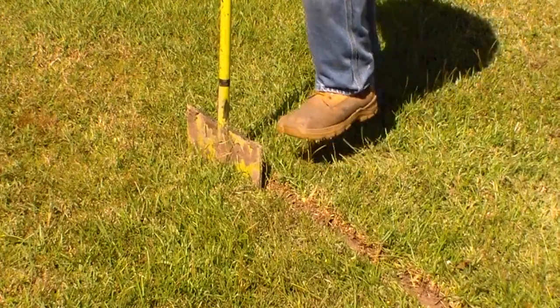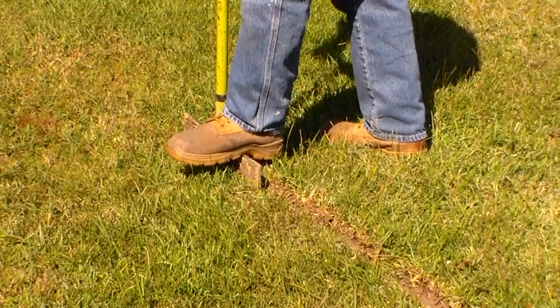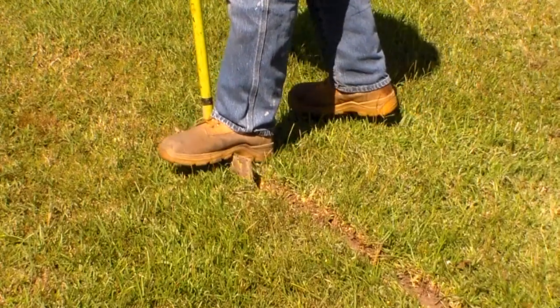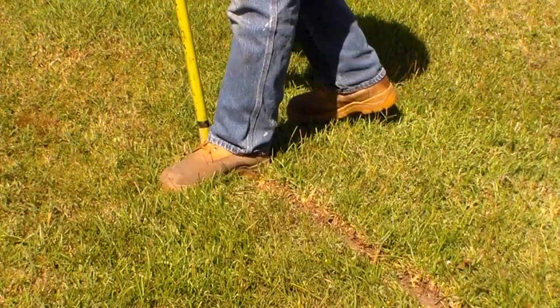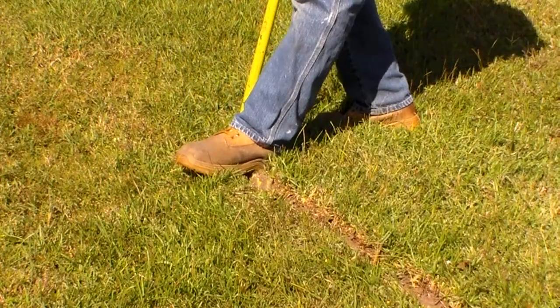Because the blade is so heavy, it can be used like a vertical axe to cut through larger roots too. On the other hand, I often use a reciprocating saw to make two cuts a little over an inch apart through larger roots — after, of course, making sure that there really is a root. This needs to be done to ensure that the insertion tool will later be able to press the pipe or wire past it.